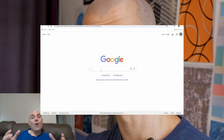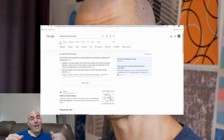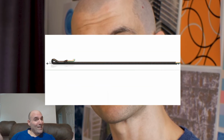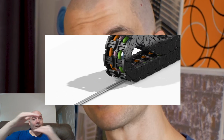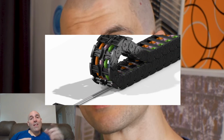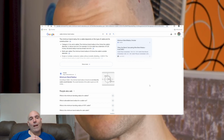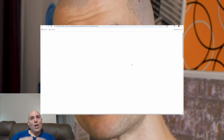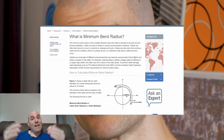And that rating, once again, should never be exceeded, because if it is exceeded when they install that cable inside their cable chain, because once again, we're dealing with robotics, right, Paul? You know that. And that cable chain goes back and forth on the X and Y axis. Therefore, if that cable running within that cable chain exceeds that rating, you're going to have what's known as internal lead fracturing, which actually causes the cable to fail prematurely due to those leads within that casing failing, meaning they actually break. This is not good.